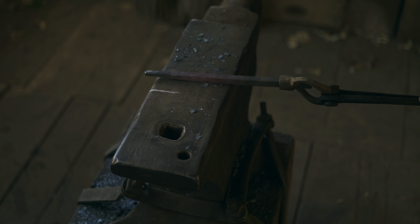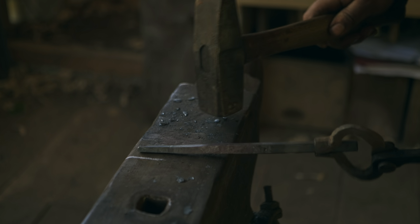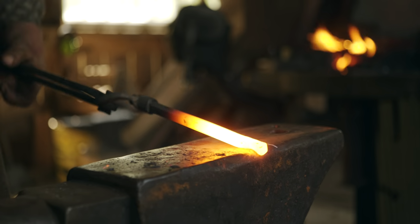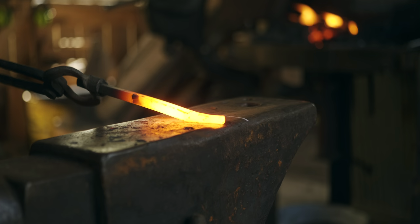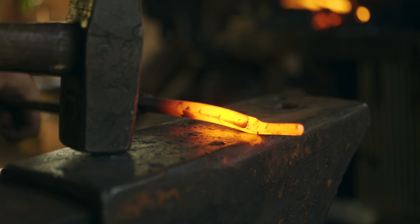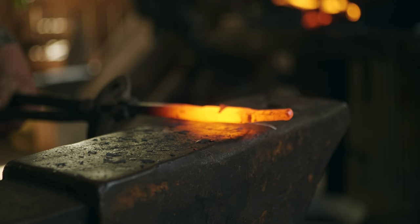All right, so we're getting close. We're within 1/4 inch of our length already. And if I hadn't wasted my heat, I'd have enough heat to go ahead and octagonalize it. All right, second one is hot. Same thing. Draw the end out about 1 inch and 1/4 of it, maybe, down to just under 1/4 inch. And then we're gonna draw a taper out between.